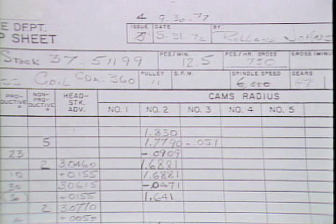If the production rate for the job is 32 parts per minute or greater, the straightener camshaft ratio will be changed from 1:1 to 2:1. The straightener camshaft in the 2:1 ratio will rotate once for every 2 rotations of the main camshaft. Because of this 2:1 ratio, twice the length of a part must be straightened with 1 straightener slide stroke.